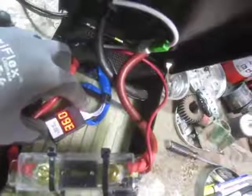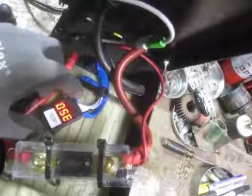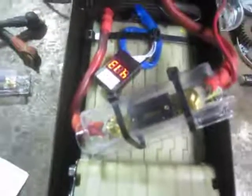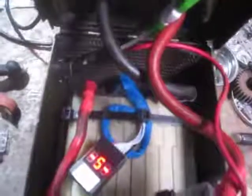If I click on it once, it tells me the alarm is going to trigger at 3.6. I actually want it at 3.5 — there's a tiny little button on top. So now it's set so that if any one of the cells drops under 3.5 volts, it will start screaming at us to go recharge this battery. The whole thing is so snug in the box there's really no movement; I don't think there's going to be any abrasion, but if there is, it'll be riding against the rubber and foam underneath.